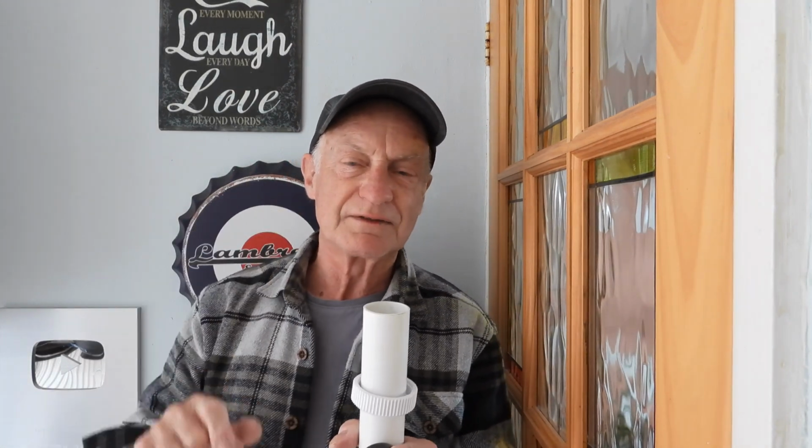If that is leaking from there, you can use PTFE tape around it if it's not a very good fit, and usually that will take any leaks up from there as well. Do make sure the siphon itself is tight in the cistern, because you'll be able to see it running down the outside of the pipe and the thread coming down onto this, so you'll know if it's that. But generally they're the two problems, and quite an easy fix.